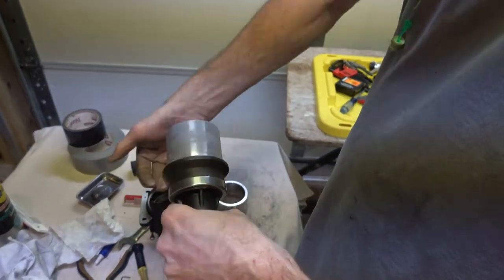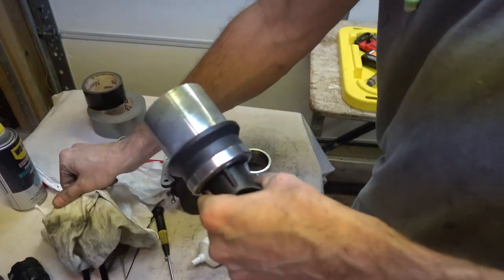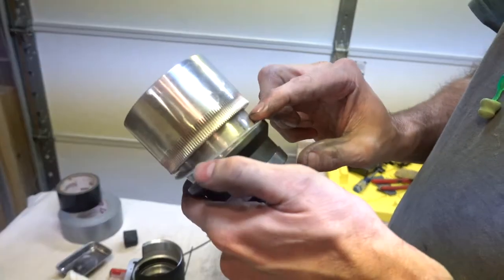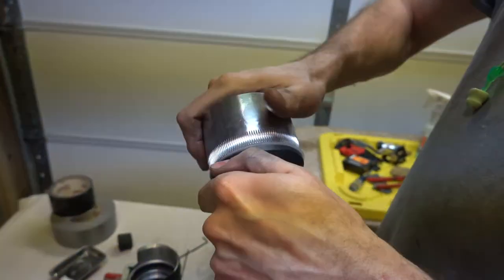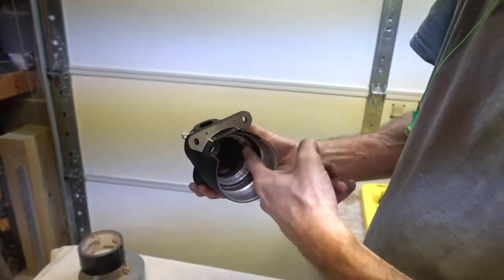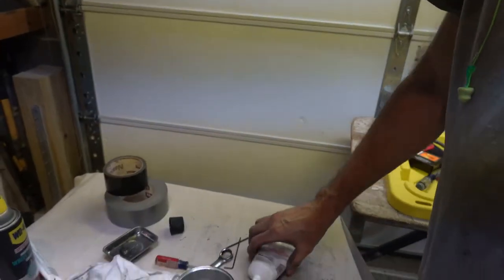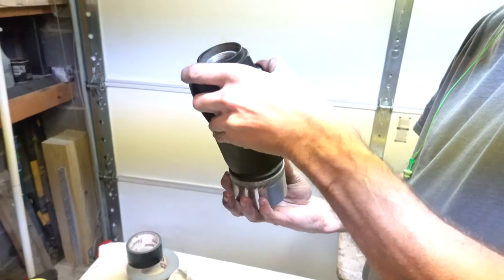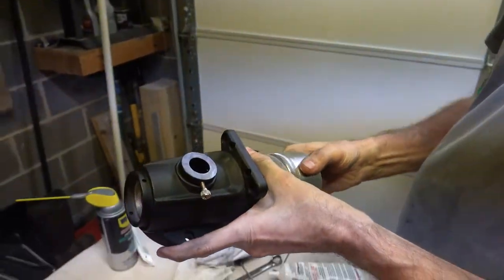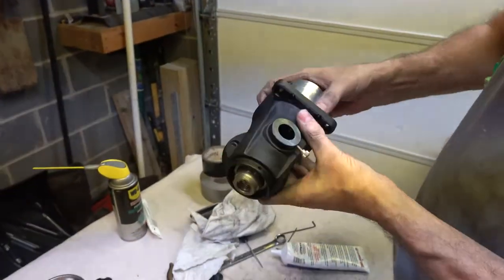Guys, with the point of applying lithium grease, it's sticky enough to where it'll never run out. And then remove excess. Then I'll keep that surface from touching. More lubing, more lithium grease applied. Reassembly of the DEC, which is not even the focus of this video, which is the RA axis bearing.